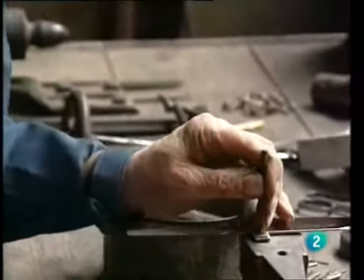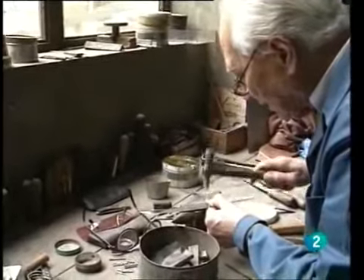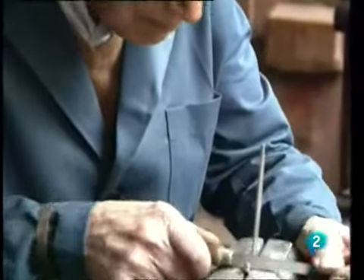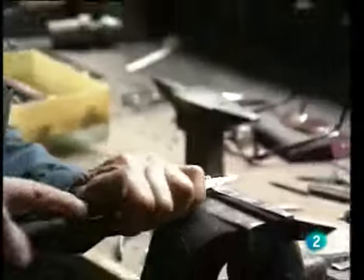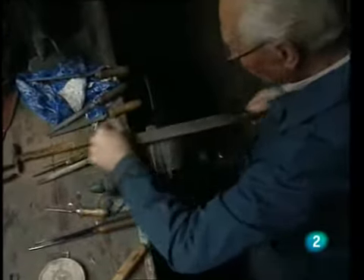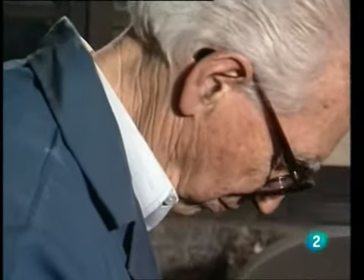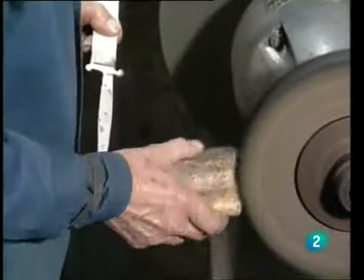In this delicate and slow phase of placing the crossguard, the knife-maker uses the small anvil along with an assortment of fine tools and files of different cuts that are reminiscent of a goldsmith's work. The burnisher is a hardened steel triangle used to polish and shine the corners that the stone cannot reach. For the polishing of the alpaca crossguard, several felt wheels are needed until finishing with a cloth.